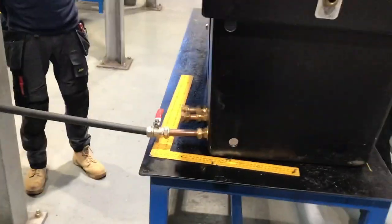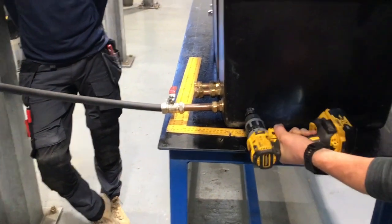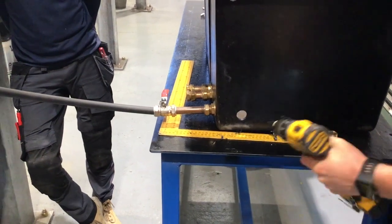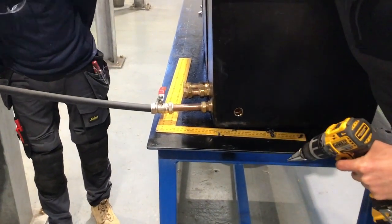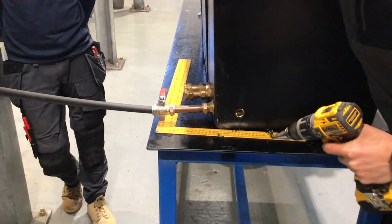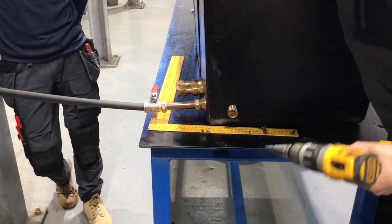And there's the drill — I'm going to test the fit every time. I'll get my connection. That's just barely fitting now, so one more step on the stepped bit should be through. That's good and tight — it should just make it through. I may even go to the next step, just to be sure. It's only one mil difference. There we go, perfect — I've gone all the way through with that.